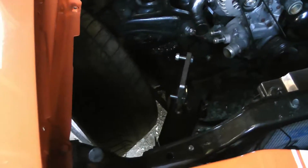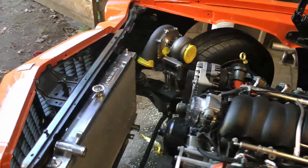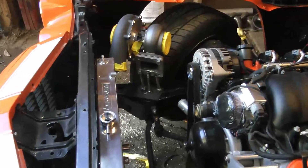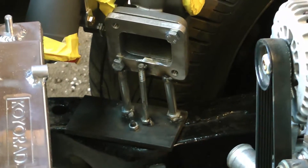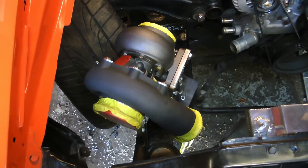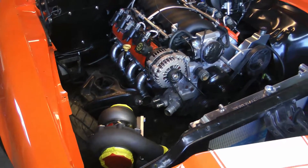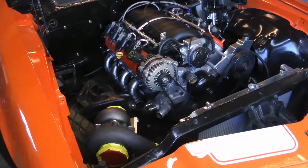What I did is I mounted the turbo flange, welded it to a piece of steel, and just bolted that piece of steel down onto my subframe. That lets me work with this location for the turbo, and now I'm going to start running the hot side over there. I should be back in a week or two with some updates — thanks for checking it out.